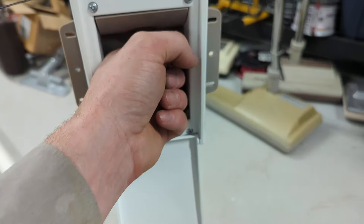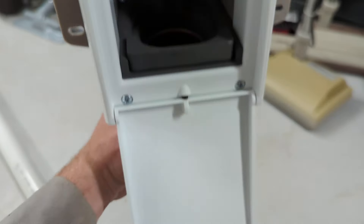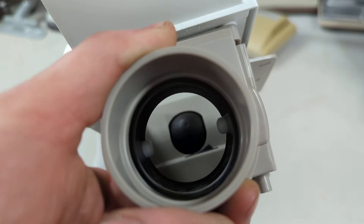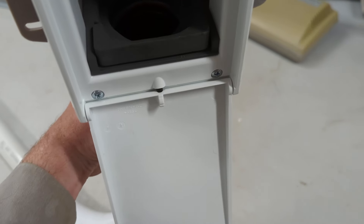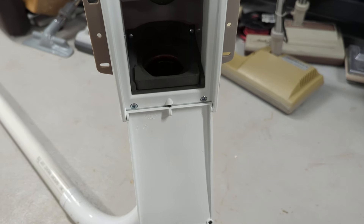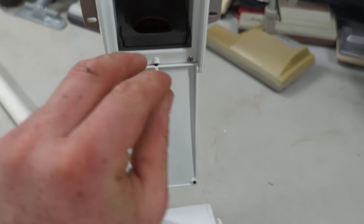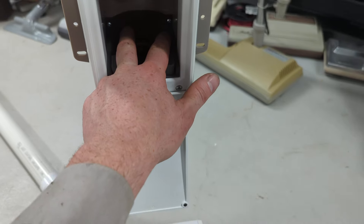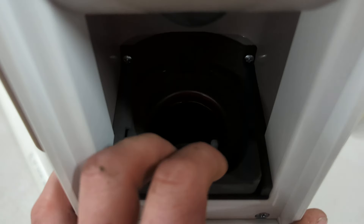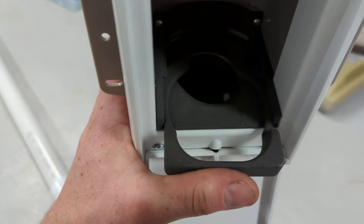To use the system, you grab the hose and pull it out. If you pull it to the very end, it is self-locking — the end of the hose engages with little pins inside, now made of durable plastic (they used to be stainless steel), so it self-locks and self-seals. It's a very good seal, but that's only at the end of the hose. When you want to vacuum with the hose partway out, on current valves you just take the little clip, pull it out, and stick it in to hold the hose — it doesn't seal it, but it holds the hose from going back in. There's a prototype now where that hose holder is integrated, so you just pull it out.